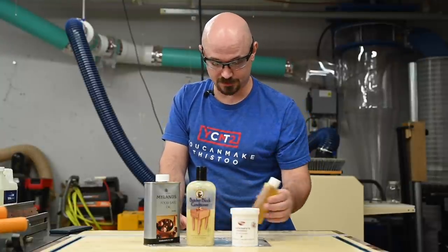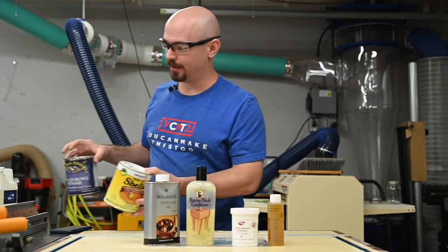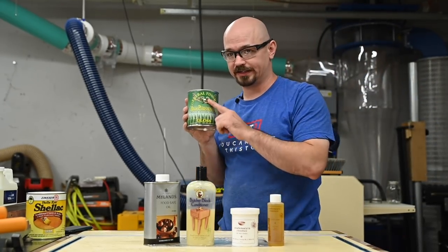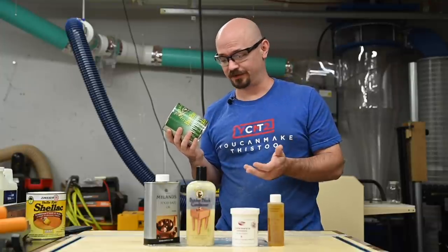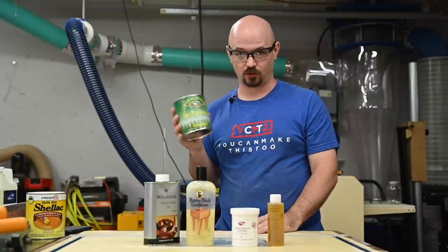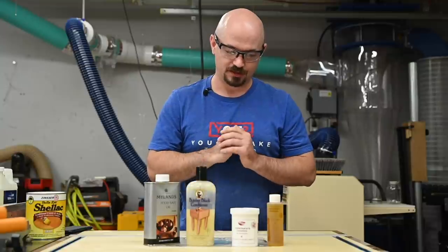So just to say the same thing again, if you're hesitant about using something that's probably okay for food but has some things that are going to go away that the FDA says is cool, and you definitely want to stay away from things that are not touted in that other category of stuff I just moved, but according to 21 CFR 175, it should be totally safe for food, just companies understandably don't spend all the money on testing to be able to make those statements. You can totally use that. If you're not comfortable with those options, then just stick with something that is food grade. Because if you can eat it, for sure you can put it on your wood products that you're going to put your food onto without any concerns.